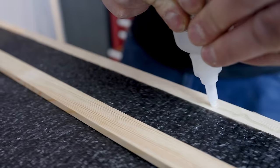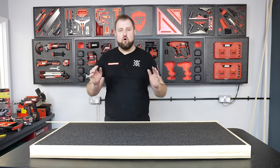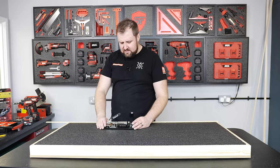We've got a little bit of bead trim — also from B&Q — and we're going to mitre glue and pin this around the front. That's going to hold that piece of foam in there, frame it really nicely, and if we ever want to change it I can unscrew the back. As regards to the pocket hole jig, I got on with this quite well. It was really simple — literally just set the depth of the clamp, clamp the wood in place.